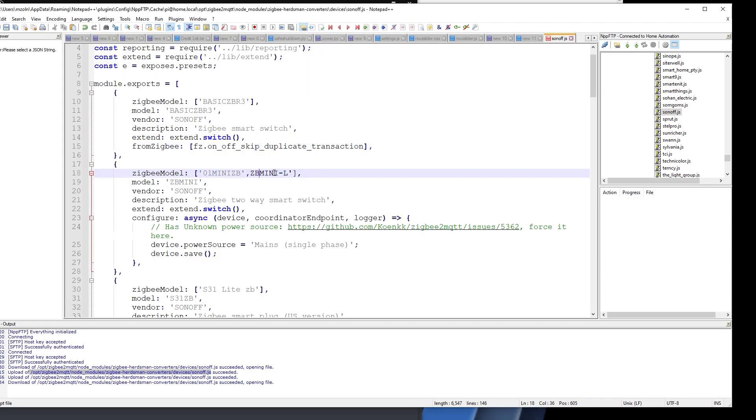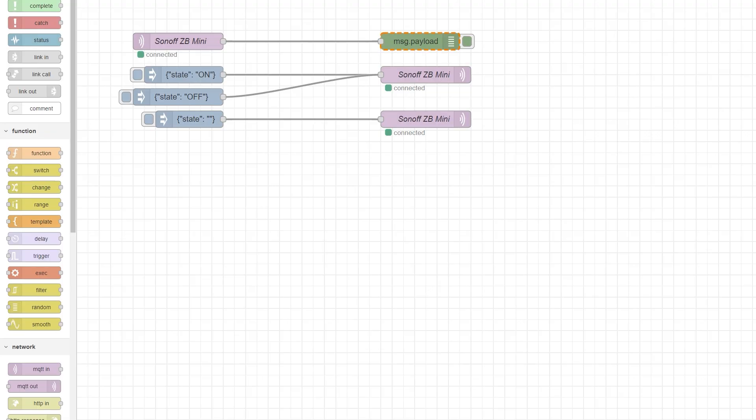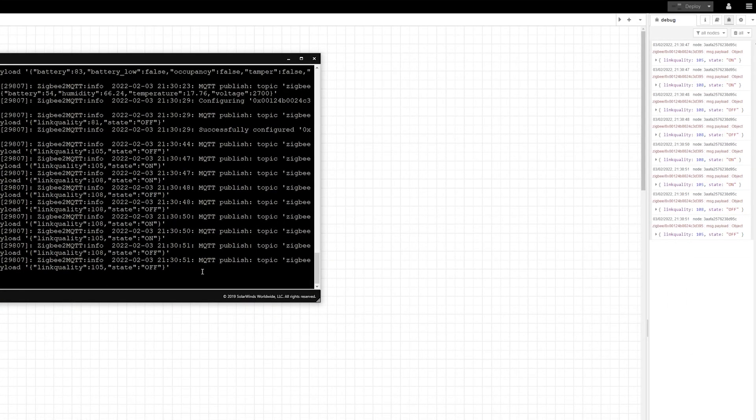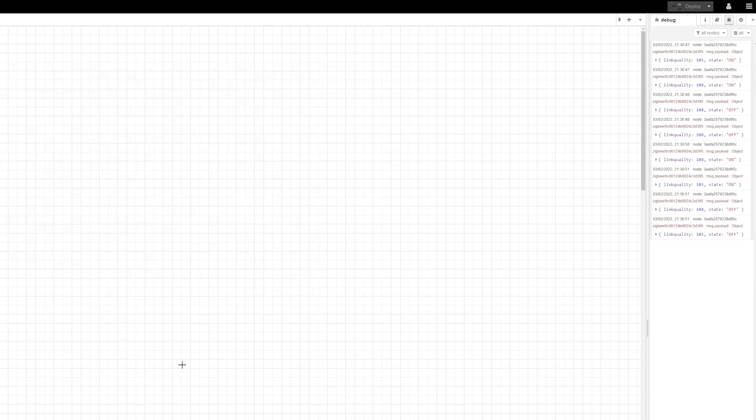Of course I would give it a go with my custom coordinator. The device pairs quickly, however it isn't supported just yet — but chances are by the time you're watching this it may already have been added, because I'm going to submit everything about it very soon. All you have to do is open the devices from Sonoff and add the model number to Zigbee Mini, since it uses exactly the same controls. Once connected you can control it with the usual MQTT payloads — state on and state off to toggle it, and a status update to get its current status. Even when toggling the wall switch itself, it sends updates really quickly with no problems across the three coordinators I tested.